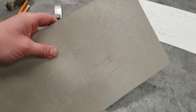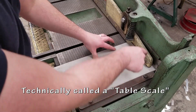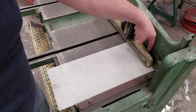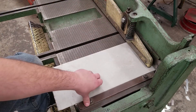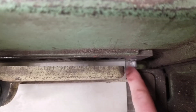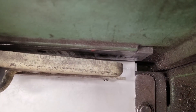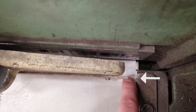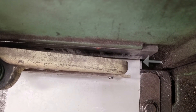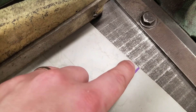I'm going to cut these on the foot shear. Bring your metal to the foot shear and use one of the side fences so that you get a 90-degree cut. You're going to want to look down the crack in between the blade and the part that clamps it down — when you press the foot pedal it clamps. You want to look at the edge of the table, because that is what we're lining up our lines with. If your line is back here, it's going to cut in the wrong place, so move it forward and get it as close as you can.